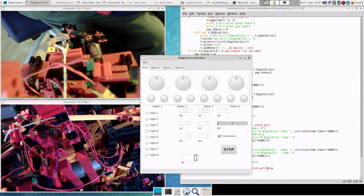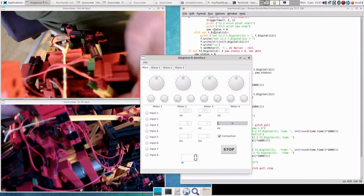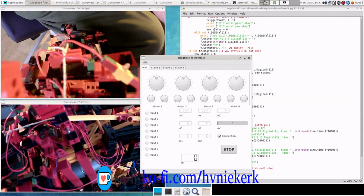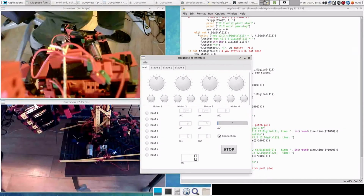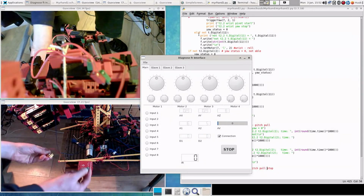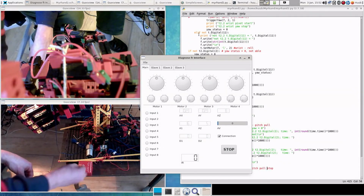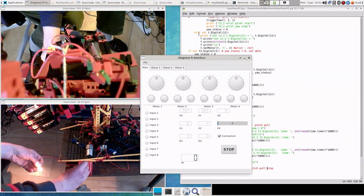And that doesn't clearly go as intended. The signal is coming through, no doubt, but somehow the LED doesn't show anything, so I will have to check whether the LED is operational, or whatever is going wrong. I'll have to put a power supply and check it. Alright, so all I need is this battery pack and the LED in question. So connecting wires, and then the wires should actually stay in place. But maybe it just goes like this, and you can see that there's nothing wrong with the LED.